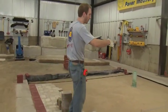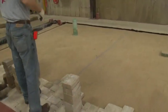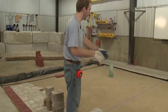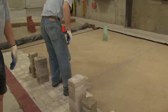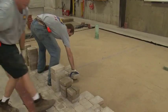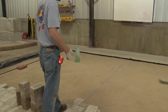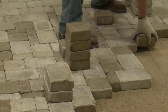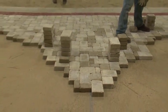We're going to be building out into the shape of a pyramid so there will always be two laying faces — on the right side and on the left side. The paver runner will keep running pavers and stacking them along the laying faces on both sides so that you have one setter working at the top of the pyramid, constantly building both sides all the way down keeping even on both sides. You always want to keep in mind that you're going to start laying from the lowest point on the project so that gravity keeps your pavers tight together. The paver runner is responsible for making sure the pavers are stacked properly and evenly spaced and oriented for the paver setter to maintain an even pyramid and laying face during installation.